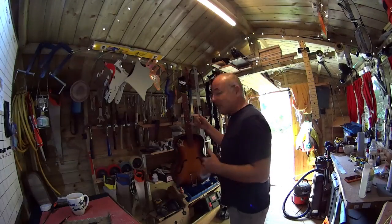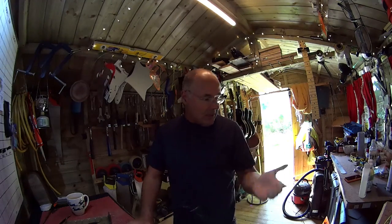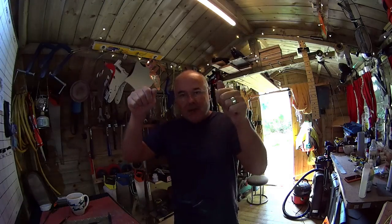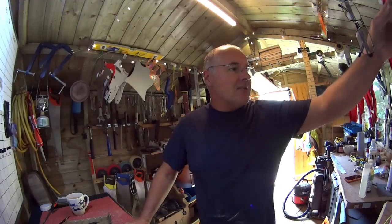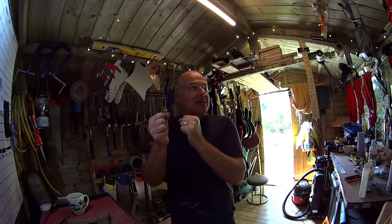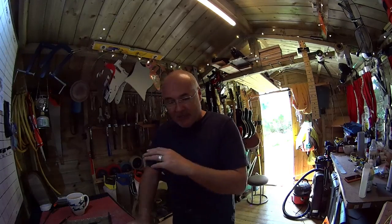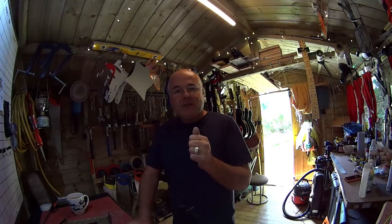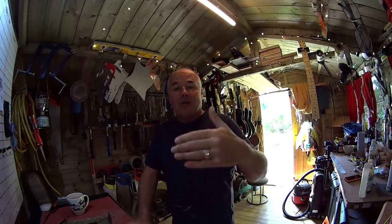If you're going to do it with frets already in on somebody's guitar, then you have to get exactly the right depth, which is incredibly difficult, whether you've got a pillar drill or a hand drill. With a hand drill, you can gauge the depth with a little bit of tape around the drill itself, which is what I did. And even with a pillar drill, unless you've got a very expensive one, they all have a little bit of play in them, so you never get exactly the same depth each time. So if you're going to do it on a pre-existing neck, you may need a strategy for if it's slightly proud or slightly sunken. What are you going to do if you've gone too far with the drill or not far enough?